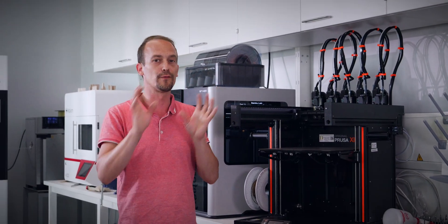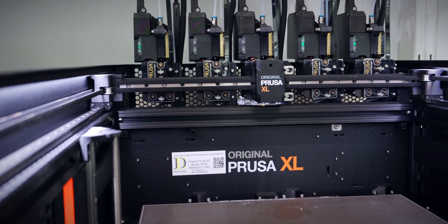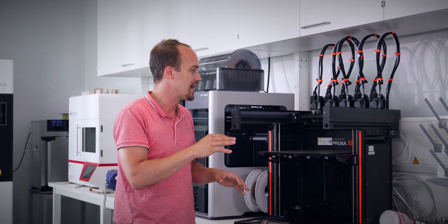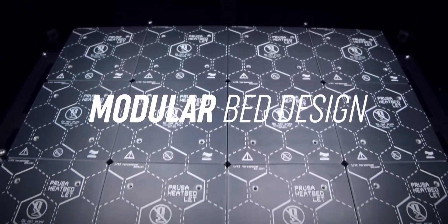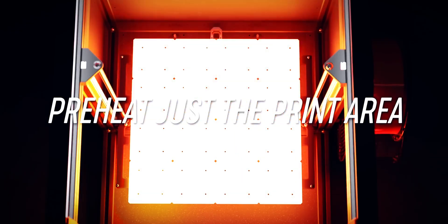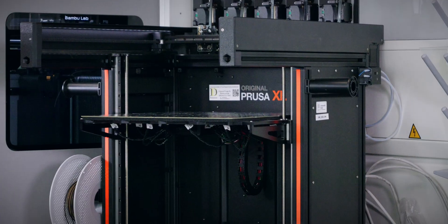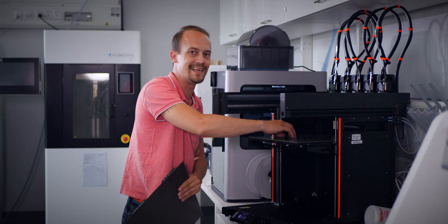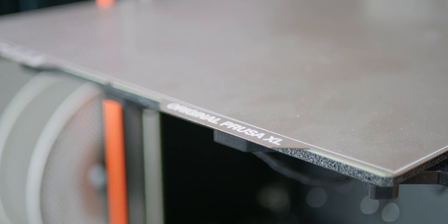That's a big advantage of having different print heads and nozzles, aside from the obvious advantage of mixing TPU with PLA, ABS, and PETG all in one print, which is possible. Another thing I really like about the Prusa 5 XL is its segmented heated print bed. Instead of one big heater that can suffer from cold zones on the edges, you have many small heat plates. The software is smart — it knows where your tool path will go and only heats the area needed. That saves energy and makes the machine way faster to heat up.